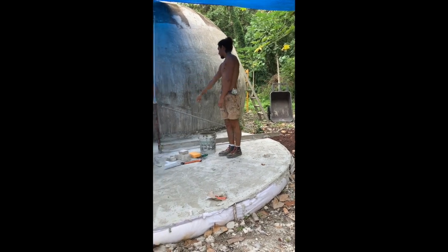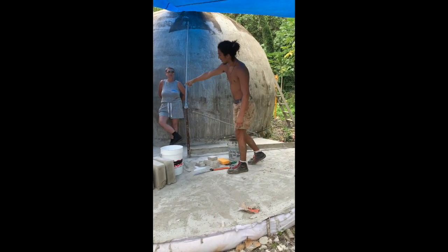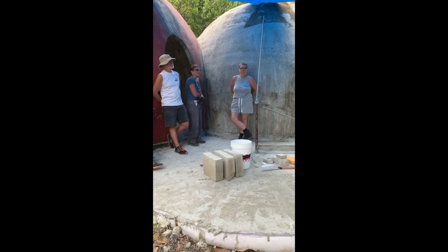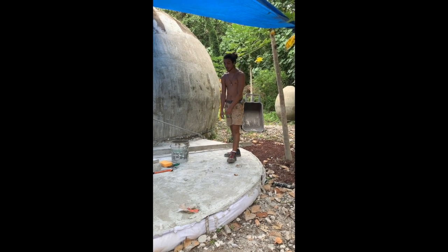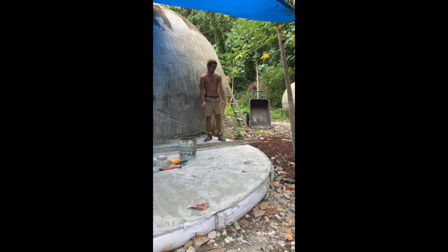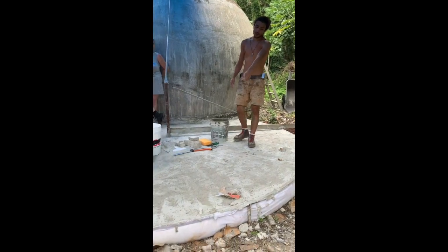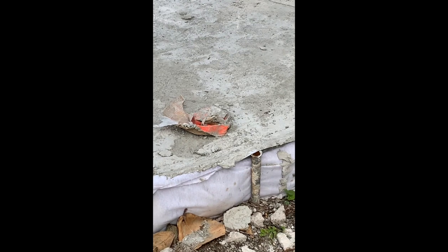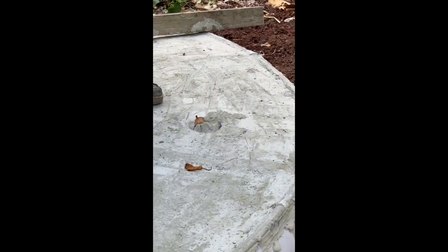If you have a corner where your screed can't really reach and you don't want it to look rough, you can set up some rails along the back to scrape it off — but it's fine as-is also. So this is the bathroom, and we also have plumbing happening here. Before we poured, we figured out: toilet right here, septic tank over there, shower over here, sink right here. So we just left the ABS pipe fittings sticking out a little bit that we're going to connect the different fixtures to, and made sure it all ran out.